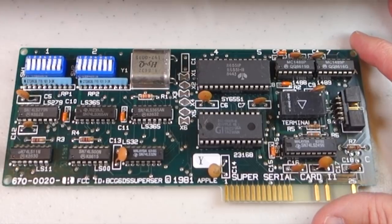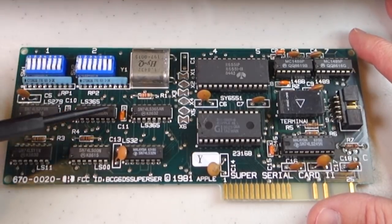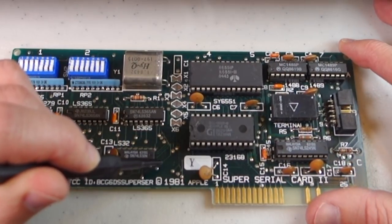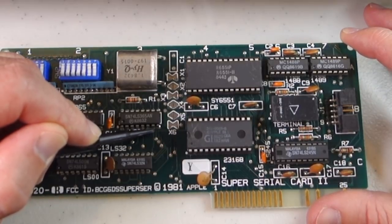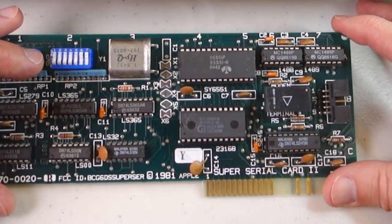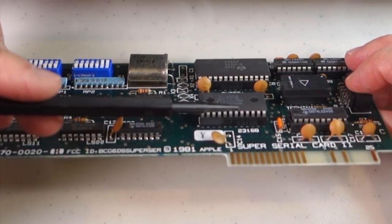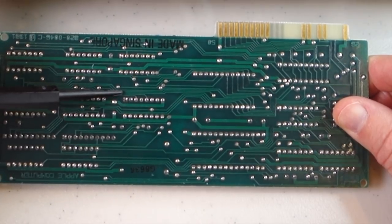Let's talk about how these boards actually work. This is a typical printed circuit board — a Super Serial Card from the Apple. The same principles apply to the Apple II itself. These circuit boards are typically made out of some sort of resin-impregnated cloth or paper, making them non-conductive. Embedded within the boards are very thin copper wires called traces that go between the mount points for the chips. This is a two-layer board: you can see copper traces on the top, and if we flip it over, there are also traces on the bottom. The chips' legs get routed via these traces to the appropriate other chip, power supply, or wherever they need to go.